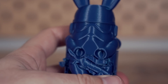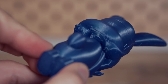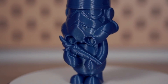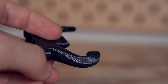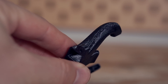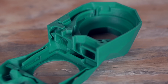The standard Cura supports just about welded to the part, so I hopped over to PrusaSlicer and created a profile based off an Ender. I've been using that slicer much more lately and really like their support system. The first print with PrusaSlicer was much better but still not perfect with auto-generated supports. On my final attempt, I went with custom supports and their snug settings — that turned out perfect and I was super happy with the end result. I then switched to PETG and printed a vase I was very pleased with, as well as the fan shroud for the Rat Rig V Minion. There are some overhangs on the shroud, and the S2 really did not like that — the small fan only hits the model from one side, so that side looks great but the other side was really messy. I verified this with a second print with the exact same results. I then threw an enclosure on the printer and printed the Voron Stealth Burner face in ABS, and I was very happy with the results — being able to print ABS at higher temps on a stock budget machine was great.